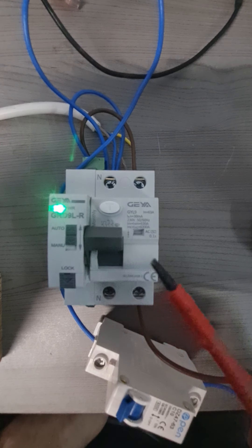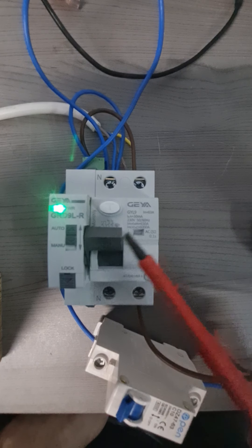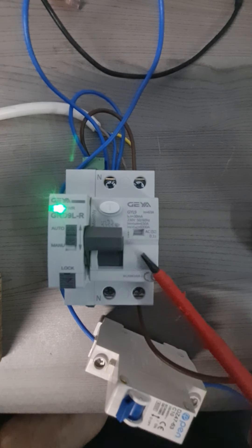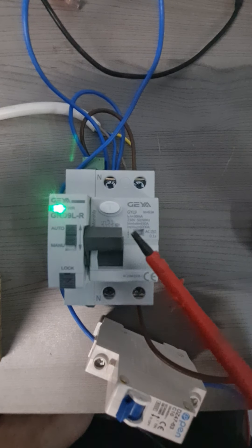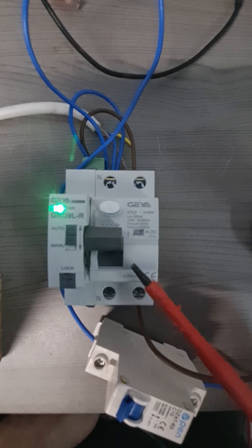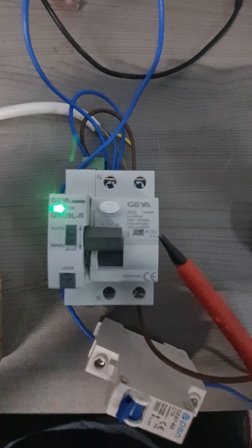This year we have installed and tested a JOS Restart Pro unit, and basically what this unit tries to do is something similar. The RCD is a 30 milliamp RCD so it can be used to protect final circuits. The only drawback is that this RCD is a Type AC unit, and ideally any modern installation has a minimum of a Type A RCD. This particular unit was brought to us by one of our friends just for testing purposes.